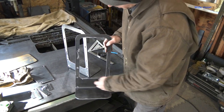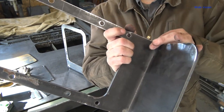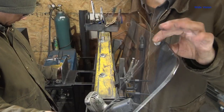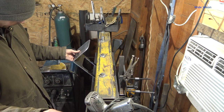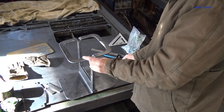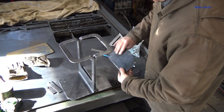The bottom hole here is too close to that bend, and it is stretching that hole out — it's just way too close to get a bolt down in there correctly. I need to move those up about half an inch or so. One spacer will go on that side, one on the other, and again my bolt holes in the top are deformed because it's too close to the top. And then the blade.